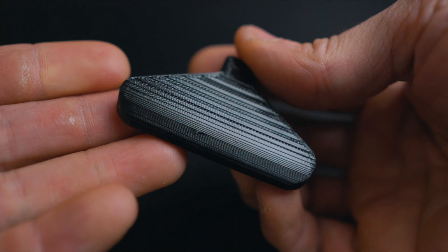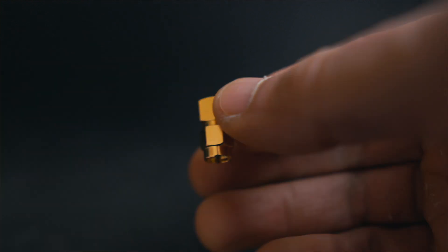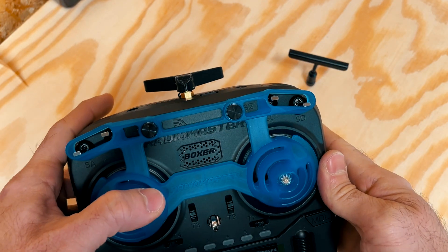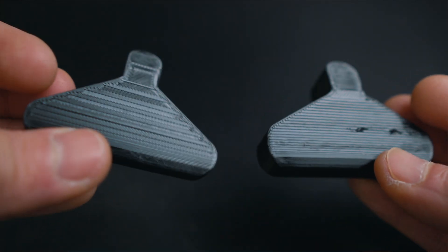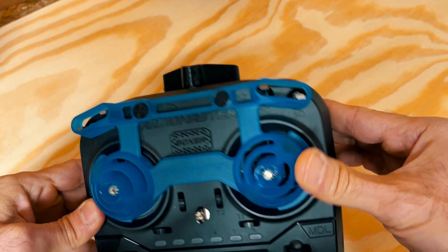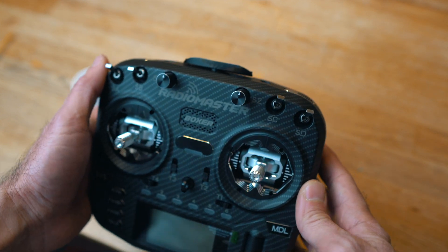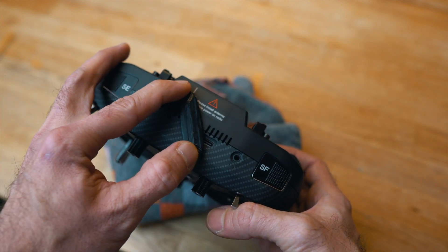Now that we have this new antenna, we need to 3D print a part that covers the whole thing so nothing is exposed and can break. Initially my idea was to do something very thin so it could be as flat as possible to the top, but the big problem is this 90-degree RPSMA connector is actually pretty big. Even when screwed into the radio, a lot is exposed, so I had to go with a much thicker part than I wanted. But if you insert everything correctly, you end up with very little sticking out. I'd rather have the first mod, which is very flat, but I understand not everyone wants to open the radio, and this still lets you throw the radio in a bag without any problem.